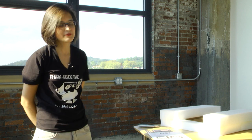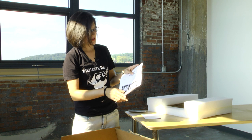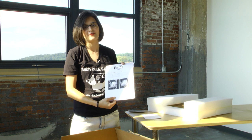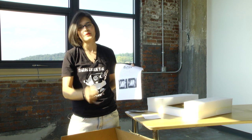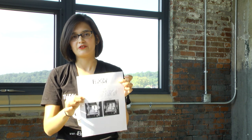Now that you've got your Boxy open, make sure you don't just immediately discard the paperwork that comes in it. Most important, in my opinion, is this warning on how to lift your Boxy correctly — it'll save you a lot of grief in the future. Basically, the gist is never lift a Boxy by the acrylic. You always want to grab it by the aluminum frame. It's a heavy machine, so please read this before you ever try to move your Boxy.